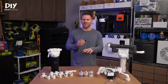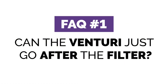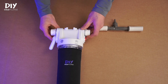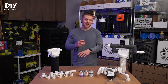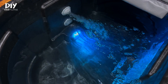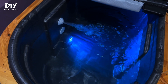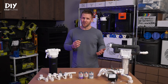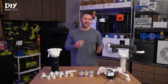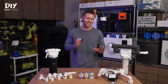Let's move on to FAQ because I get a ton of questions about this system. The first and most common is: why not just put the venturi in line after the filter? The simple answer is that the venturi condenses down and restricts water flow. So setting it up like that would greatly reduce the overall flow rate in your system, which will obviously affect the ability to circulate water. This can lead to cooling inefficiency and create backflow pressure that can damage your pump or other components in your system. So overall, slowing the flow like that is just not a good idea.